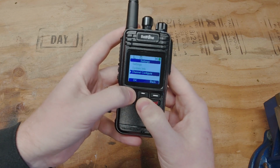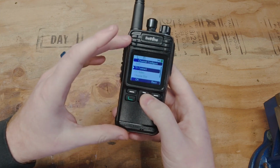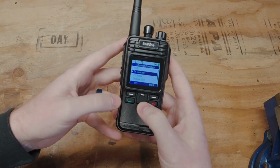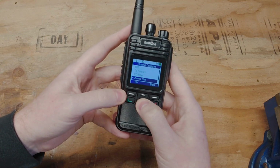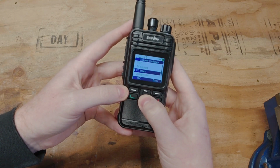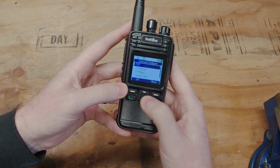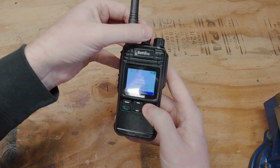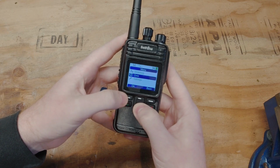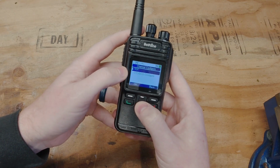and then finally we have our channel configure, where you can come in and make some changes to this channel in particular that you're on. Without the keypad below, there's actually less changes you can make. You can't change frequency and stuff like that. So timeout timer, transmit contact, CC index, choose slot, your time slot, receive group list. Those are the changes you can make there. And then really quickly we'll go to an analog channel so you can see what changes you can make in there, which is only timeout timer and then your PL tone.